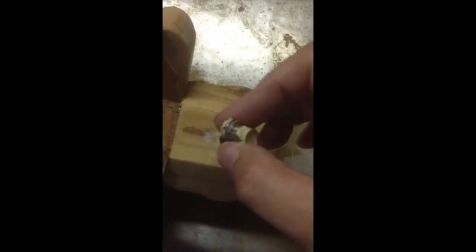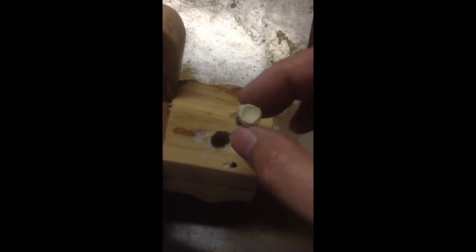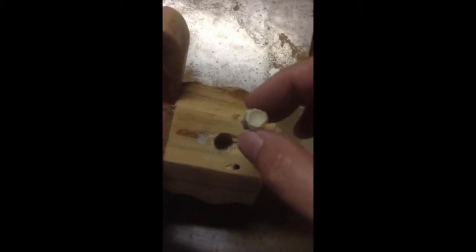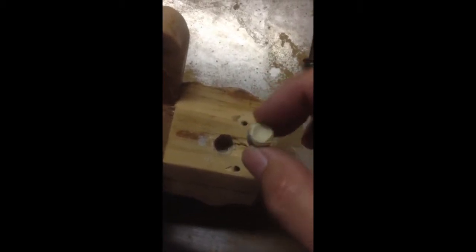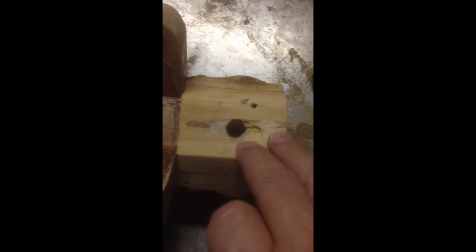The cam here, this little barrel, I've taped both ends of it so that no liquid nails or anything will get in there. And I'll be able to peel that off and screw the bolt into this once it is set into the wood. And now I'm about to fill this with the liquid nails, and hopefully it will set in there with the liquid nails.